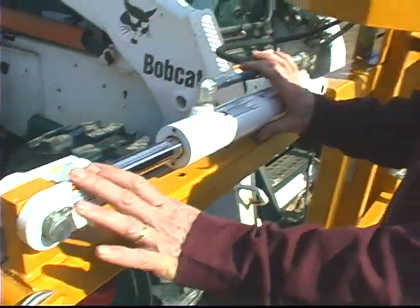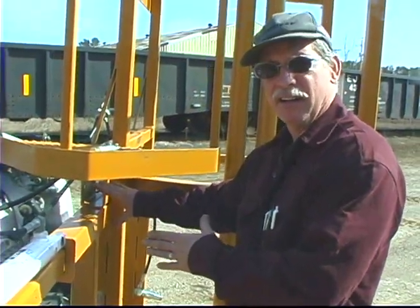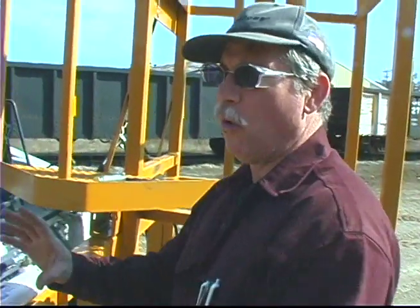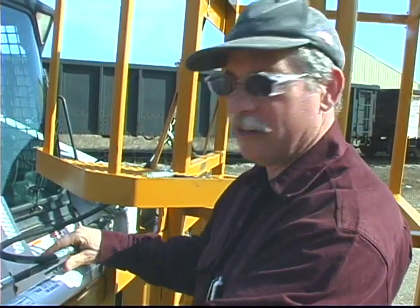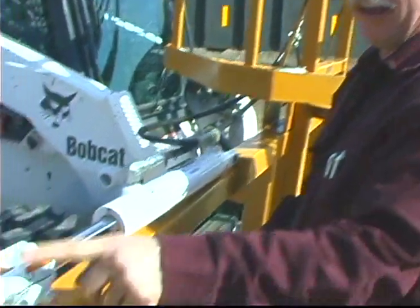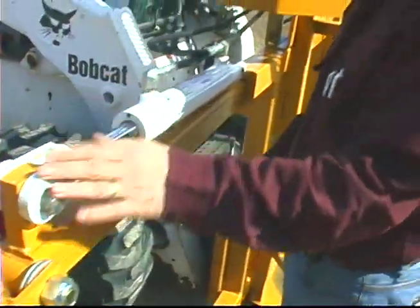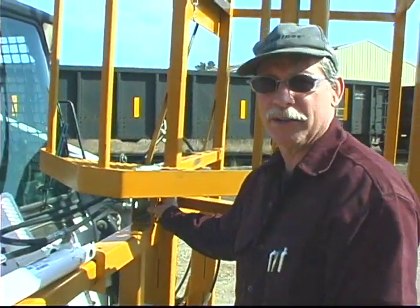Regarding the cylinder: it's best to leave it hooked up and in its spot, or take it off completely — you don't want it flopping around out by the fence. Put it back in this position, or take it off right at the joint at the stretching arm, unbolt it, push it back, and put it back in its home position to be better protected.